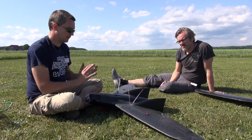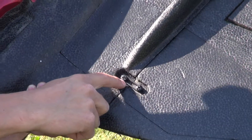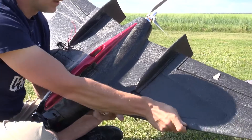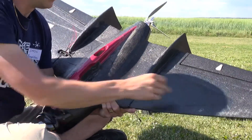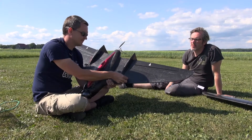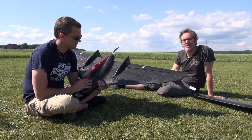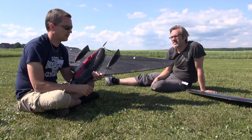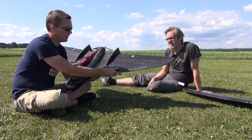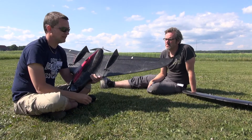Personally, I want to be able to choose and also pack it down in smaller sizes, so I use an O-ring method. This is just a piece of ply and nylon screws, with a rubber O-ring so you can just slide the wing out. I've heard some people being afraid of using just a rubber band or O-ring, but there are really no forces on this joint. It's just to hold the wings in a tight position — nothing will pull the wing outwards. The wings are held in place aerodynamically 95% by the carbon tube sleeves, which are the ones that take up the forces, not the O-ring. The O-ring only handles lateral forces, and those are almost none. Even a small piece of tape will hold the wings together.